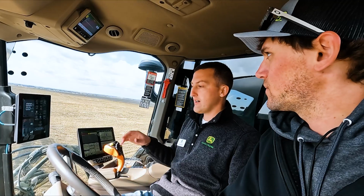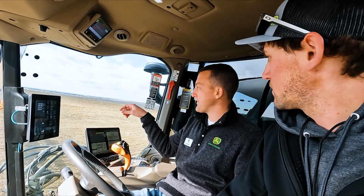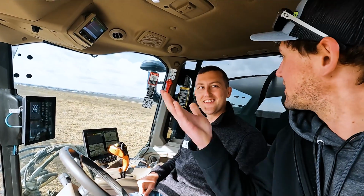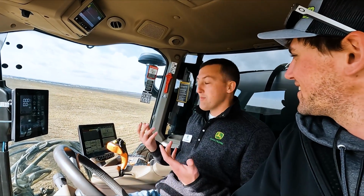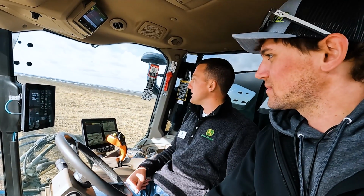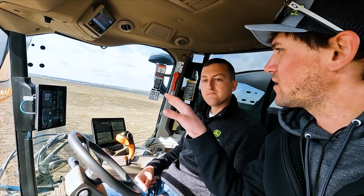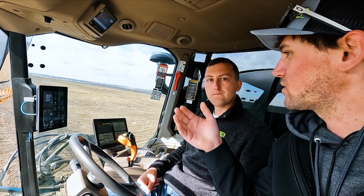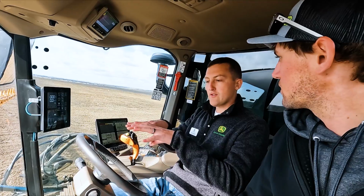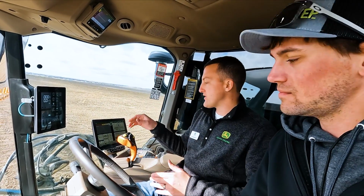If you pull up the diagnostics, say you're having a problem, you can just look in the camera, if you want to mess with somebody or see what they're doing. They're on their phone all the way at the end. Maybe you're going so fast at 15, a leaf has gotten stuck over your camera. Yeah, or mud. Mud? But like the front mounted boom doesn't really become a problem, but mud would be an example. So what happens if a camera does fail or something gets over it? Does it shut off that section or just spray continuously? Yeah, wherever it's covering, it would just broadcast and spray like normal would, and then you would see an error.